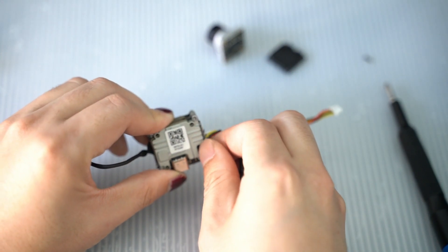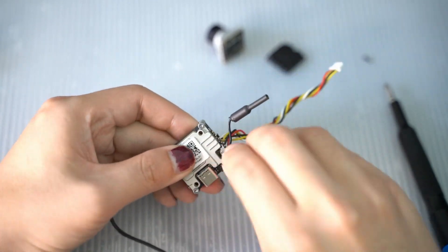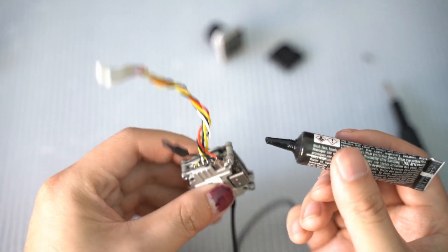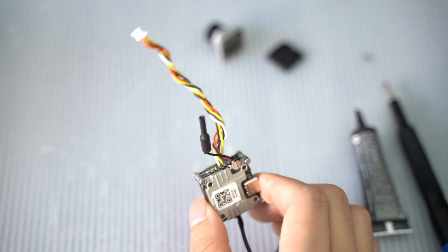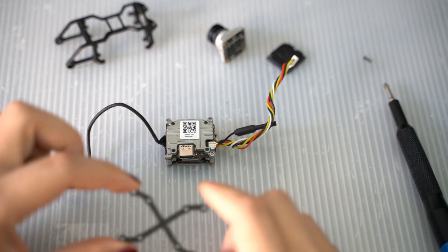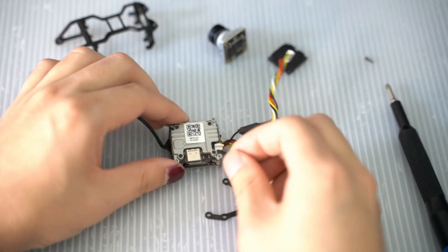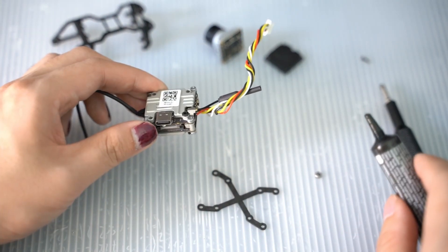Next, we're going to take one of the tiny little pigtail antennas that they include and pop it into place on the Vista module. Then I'm going to put a very, very tiny dab of thread locker on this little screw that holds the antenna clamp shut — I've noticed this likes to undo itself. A tiny bit of blue thread locker and then we'll tighten the screw down. Now we've got to mount the Vista onto the VTX mounting bracket using the special screws, securing them with the nuts and a little bit of thread lock to make sure these don't get loose.